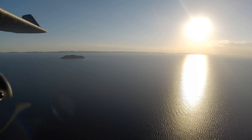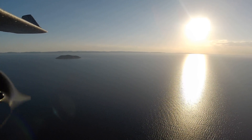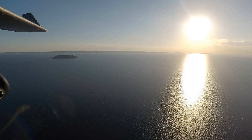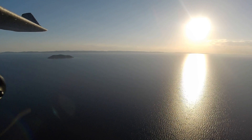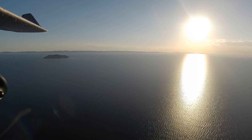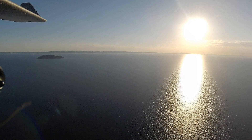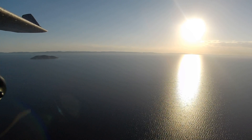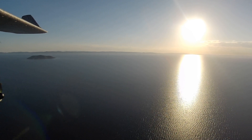The plane definitely has a lot of potential. I was able to get some pretty nice and smooth shots over the sea at sundown, though I do wish the camera had a higher bitrate and image quality — but it isn't too bad for 30 megabits per second. I still have to play around with altitude limits, but the low altitude limit can possibly be disabled by setting the transition altitude limit to zero. With its case, the Voyager is pretty convenient to move around. It is more interesting and unusual and looks awesome in the air, especially now that it sounds good. HEQ still have work to do and it seems they are committed, but for now it does a pretty decent job with a bit of work put into it.